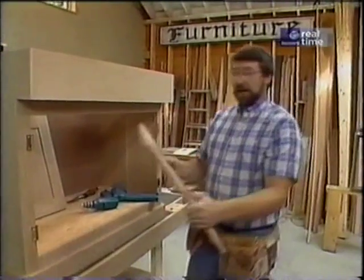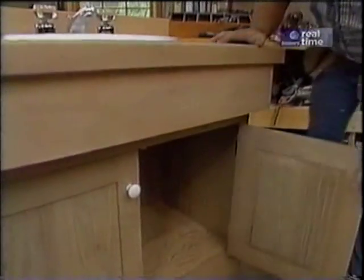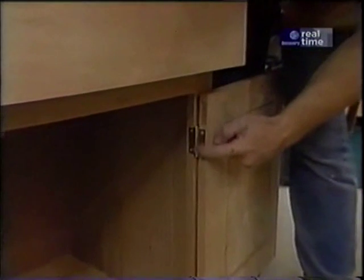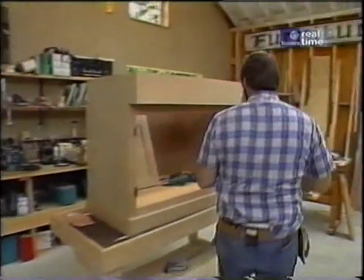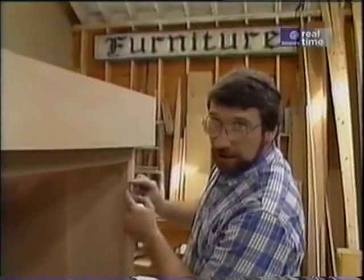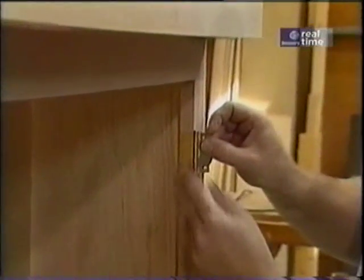Now I'm ready to get started hanging the doors. Let's go back and look at our prototype. The doors are hung in place with these little hinges. The one that's on the stile is mortised — in other words, I took a knife and a chisel and carved out the wood so it would sit flush, and the one on the door is surface mounted. The reason I didn't mortise the one on the door was because if I had, this gap might have been too small and I would stand the chance of the door becoming hinge-bound. Now to set them in, what I like to do is screw the hinge right to the stile in the location that it's going to be — that way it's easier to hold, it holds itself in place.